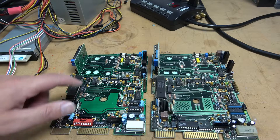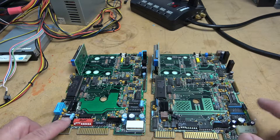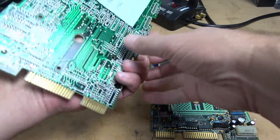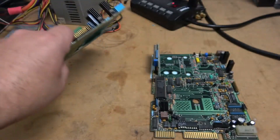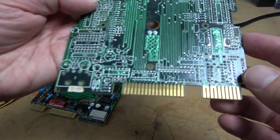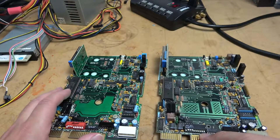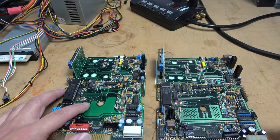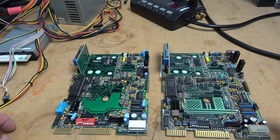It was one of these tantalum capacitors. This board on this side already has the electrolytic capacitors that have been replaced, but this is a different revision. If we look, this is revision 45001, and these are on the HH1050 and HH1060 drives. This one is revision 3307. I'm not sure what the difference is, although there are some physical changes between the two. I'm going to assume this is the newer revision and this is the older one — and strangely enough, these are the ones that blew up.